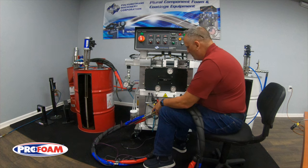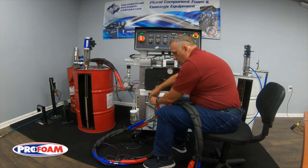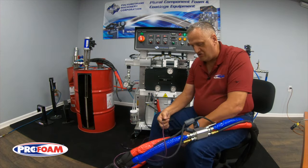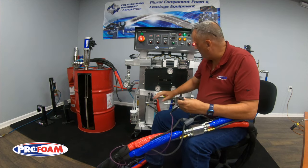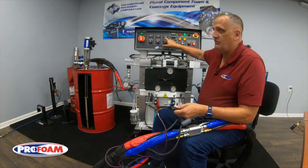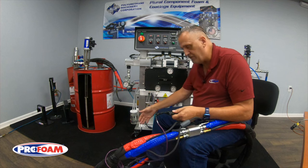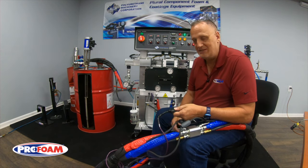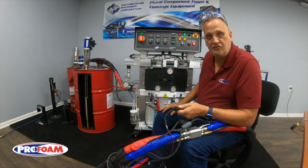The problem at this point is most likely in that purple wire somewhere — it could be in a connection or somewhere the hose is abraded and the wire is actually broken. You can walk along your hose and look for any kind of damage; if you see it, that's probably where it is. Otherwise, open up the connections, pull the scuff jacket back, and unplug them. I know this section is good; I know that's good. If I put one section of purple wire between here and there and it reads a number, that piece of purple wire is good. I can keep adding sections, narrowing it down until I find out which section is causing the problem and address that. That's how I troubleshoot for that error code. I'm Ken Anders with ProFoam — thanks for watching.